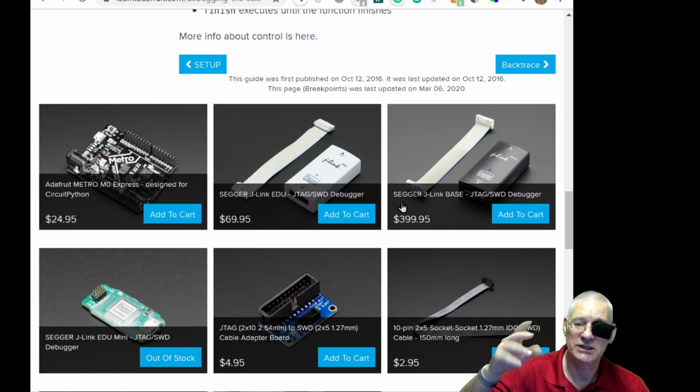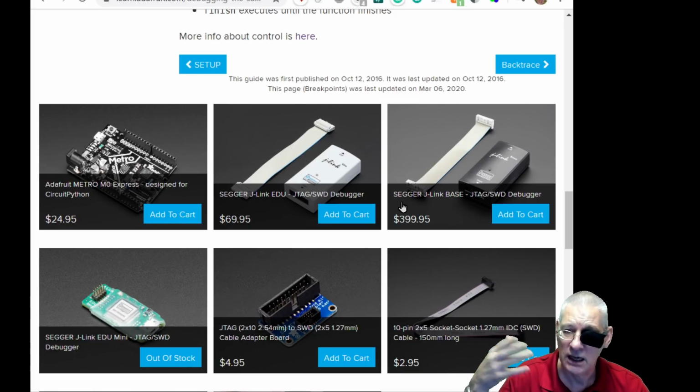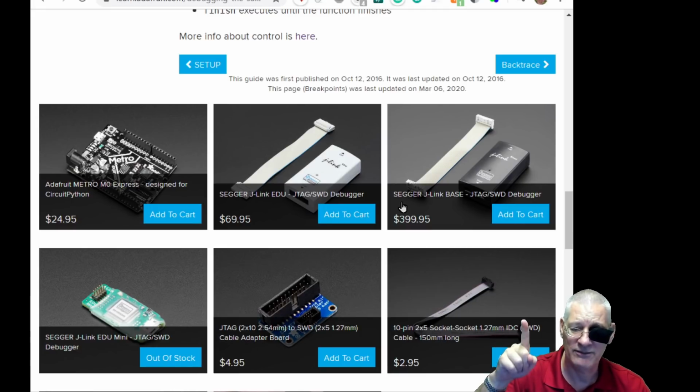The idea, of course, is that you could develop with the Arduino Zero and its debugging tools, get it all up and running, and go, yeah, that's it, all nicely done, and then just move that code over to, say, a Seeed Studio Xiao, or even the Adafruit Trinket. It's the same chip. It should run as it should do, unless you need lots more pins, of course, in which case you'll have to find a different SAM D21 board. And there are a lot of Chinese clones now appearing. They don't have the 2 ports, though. They only have the 1 port, which is the programmer's port.